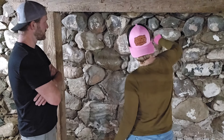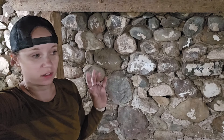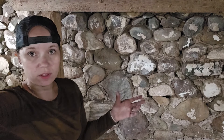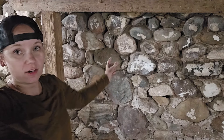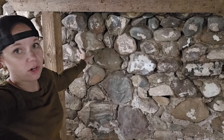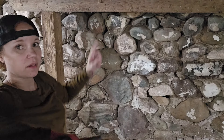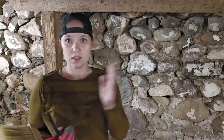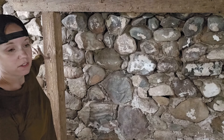This is way harder than I thought — I went into this very naive. This part of the wall is just crumbling. The mortar is sand; it's not even something that can really be chiseled out — the more you brush it, the more it comes out. So what we've decided is to start with a chunk right here. We've cleared the mortar out as best we can. We're going to work on that, go all the way down to the bottom, and then build up the top, doing two-foot sections bit by bit. This is the worst part, probably on this side of the beam and directly on the other side. So if all we get is a four-foot stretch done, that's at least going to help for this winter and the coming spring.